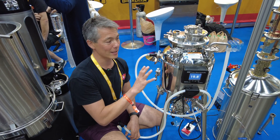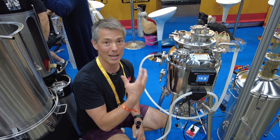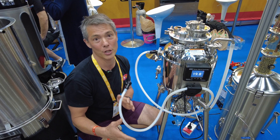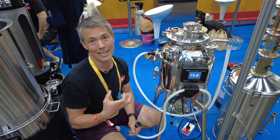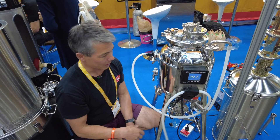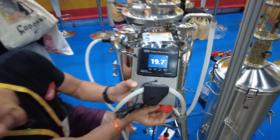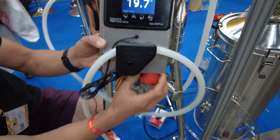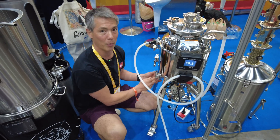The other thing is for fermenters, especially when people are using the larger fermenters, getting a decent amount of heat in there can sometimes be necessary if you're brewing in the garage or a colder climate for instance. And really the only way to do that properly is using an AC power source for heating. So what we've got is an AC outlet on this Wrapped Glycol Controller. You can see on the bottom here we've got a standard AC power outlet. So you can plug in something, for instance, like our Warming Wizard into this two inch TC port.